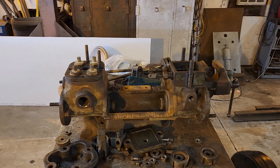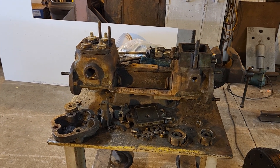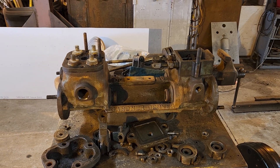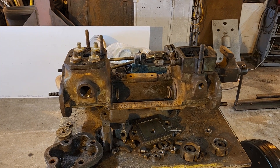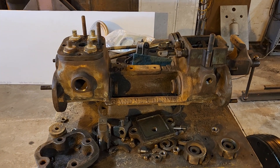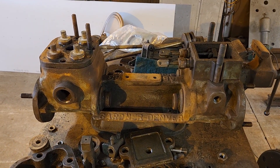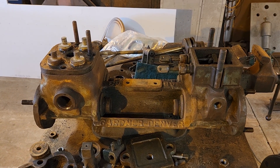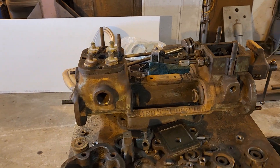We tried the Garfield double jets - none of those worked at all. So I thought, what if I just use a steam pump and a heat exchanger and just direct feed from a steam pump? This pump here will work up to 200 psi and positively put water in at whatever pressure we're at. It will also give us a third means of adding water to the boiler.